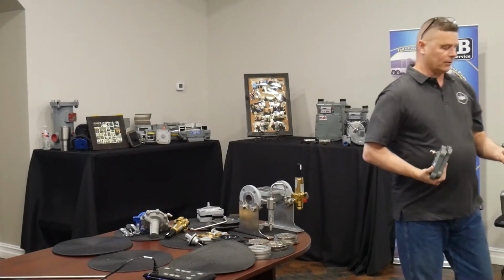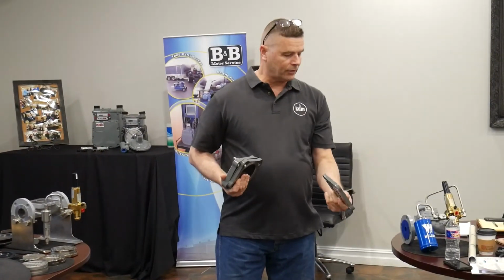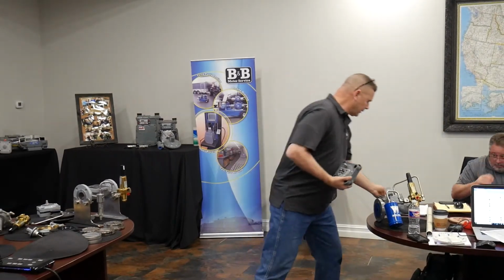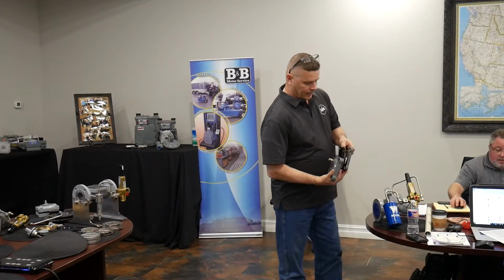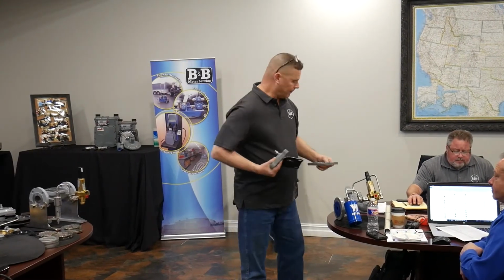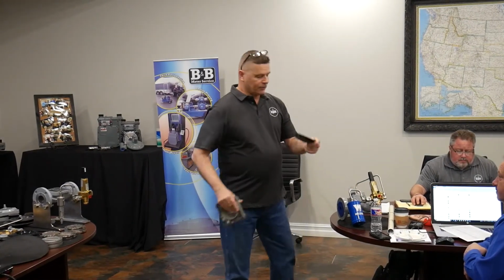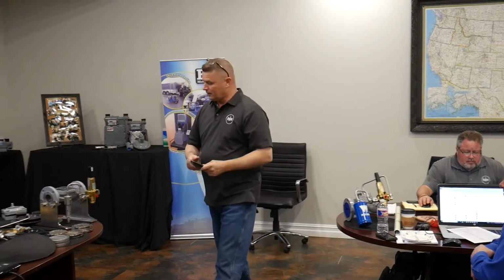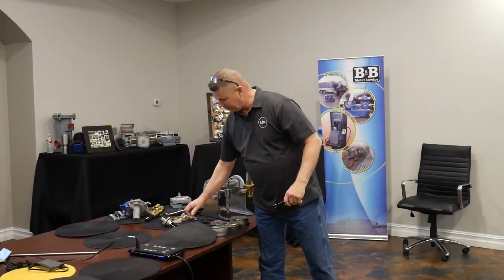So this is what you see with that, by the way, before I go any farther: here are those spacers or the layers I was talking about. It has a throttle plate, which is full face. It has a spacer plate that gives me the ability to let the diaphragm sit down and lift up from. It has a smaller interior dimension diaphragm, flexible element.